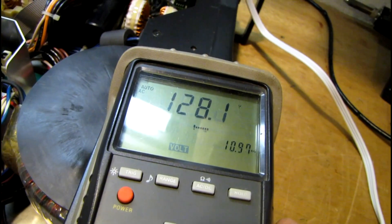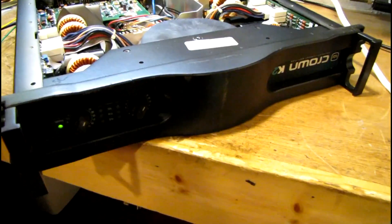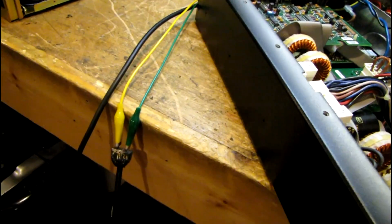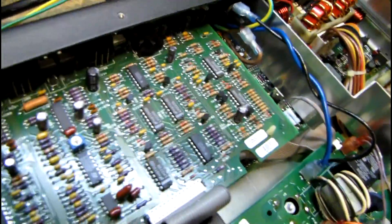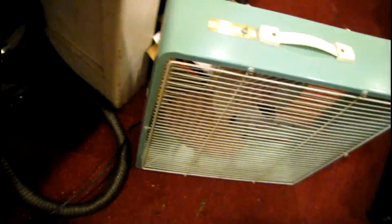Got to be careful with these things. That said, I'm going to have a little bit of fun with this so you guys don't have to. These larger amplifiers have a ridiculous amount of voltage available at the speaker terminals, and just to prove that, I've got alligator leads coming out of the speaker terminals here in bridge mode. I've got them clipped onto a plug, and that plug goes to a box fan — a 2.2 amp full-sized box fan. I'm going to run the fan right off of the amplifier.